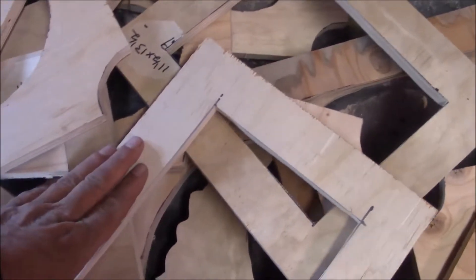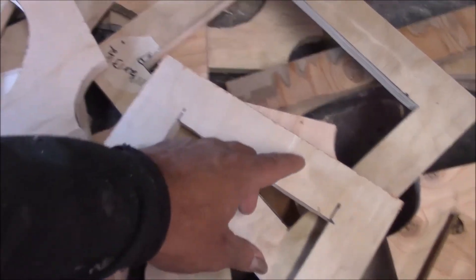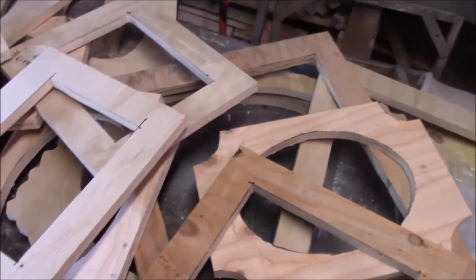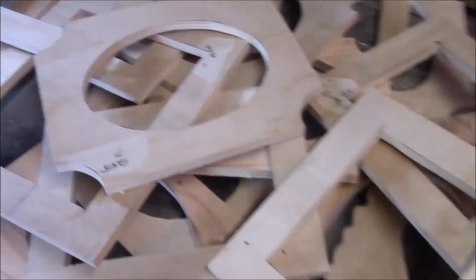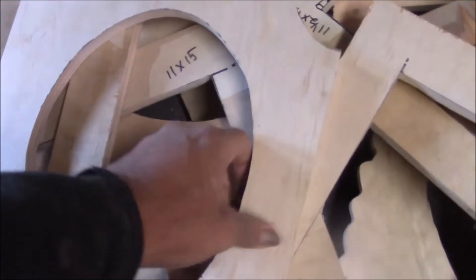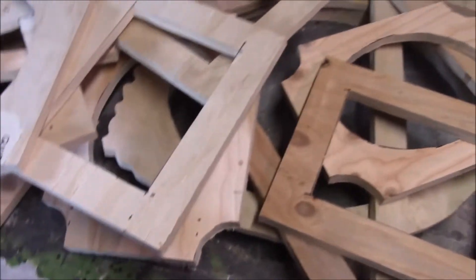Now they're all cut out. I need to go back through and sand the inside and outside of them, and there's some detail work to do too. On the old picture frames I used caulking to do different patterns and designs on each frame. With these I'm going to use a different technique - not sure exactly how yet. I also need to turn them over and cut a groove into each one to accept the pictures and the plexiglass. So that's pretty much our next step.